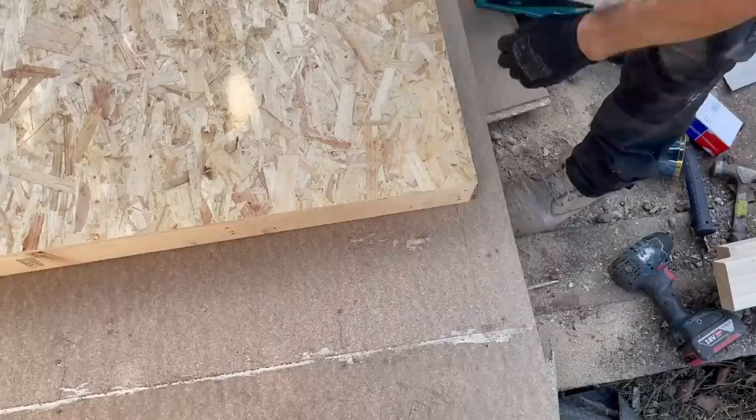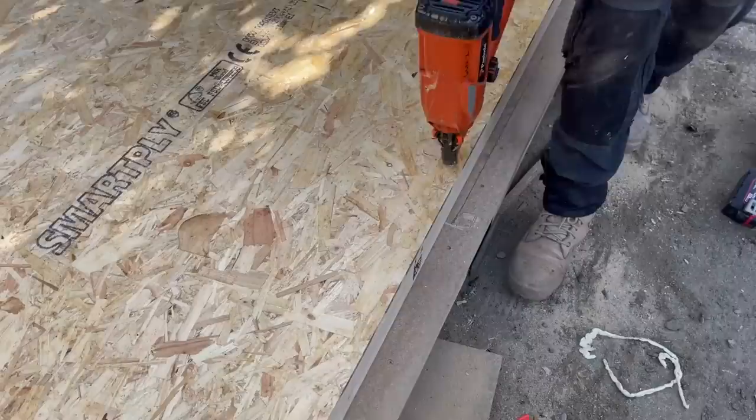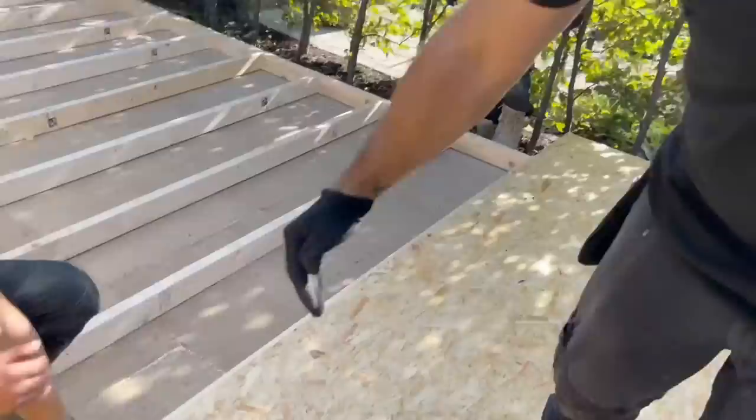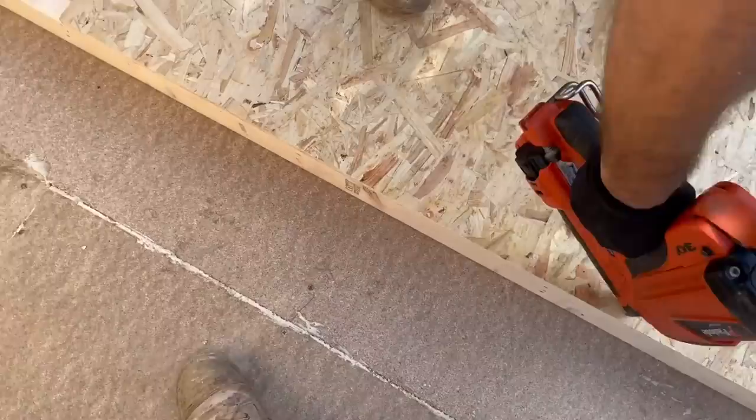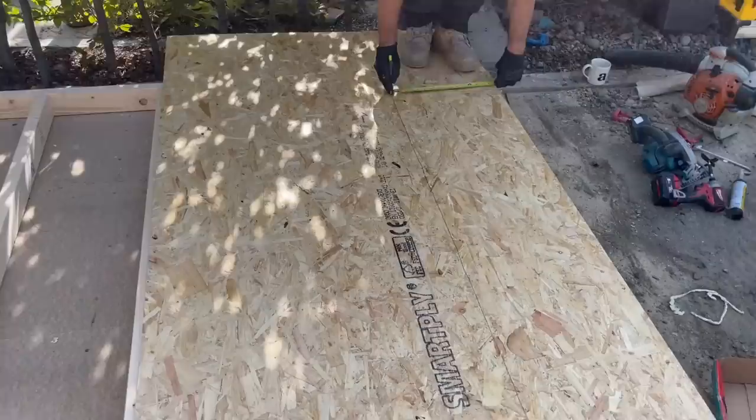Right, so I'll get that corner right, I'll get the leg right, yeah. And then, John, in a minute you're going to turn the... So once the leg is right, because the OSB is a right angle, we just move the frame to suit. And that means when all them boards go in like that, then the full wall will be plumb. I'm going to mark 400 centres now so that I know where to nail. And so on and so forth, and that will be the wall. You've seen us do it loads of times.